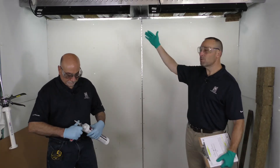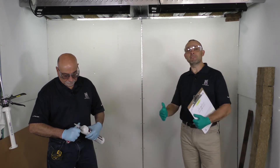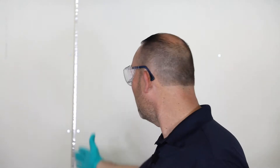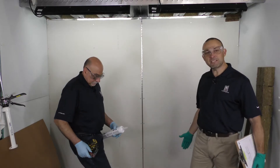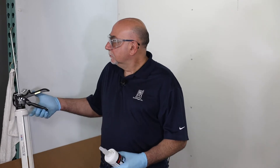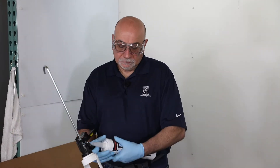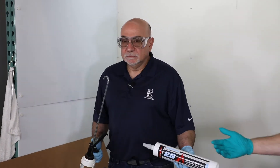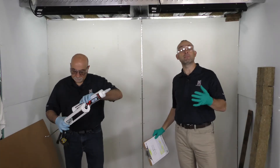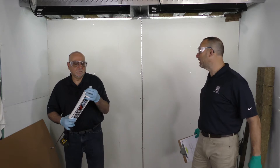We have a wall-to-wall system and a few head-to-wall systems. When you have a scenario like this, it's best to deal with the wall-to-wall scenario first. This is going to be a caulk system that Eddie's preparing. This time we're going to use our elastomeric sealant — the ES — and this is a product that's been tested to UL 2079, as opposed to our blue penetration materials.